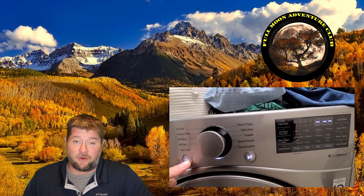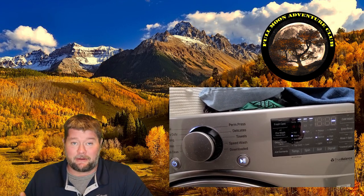It has run my refrigerator. I've done a load of dishes in the dishwasher while it was running my entire cabin. I also did a load of laundry in the washing machine. I can't use it on my dryer because that's a 220 volt dryer. But if you had a gas dryer, this would run the drum and run your dryer if it ran off gas. Electrical, no, because this is a 110, that's a 220.